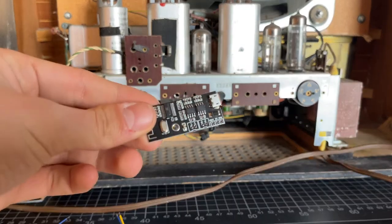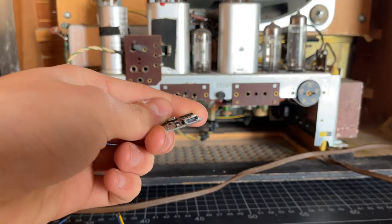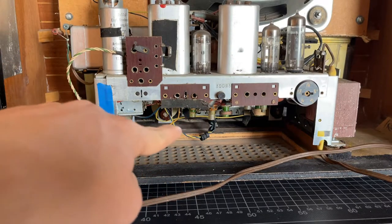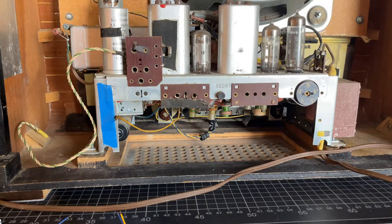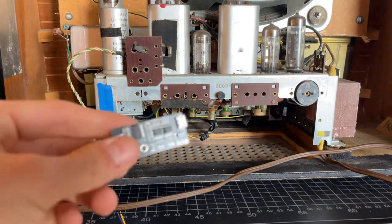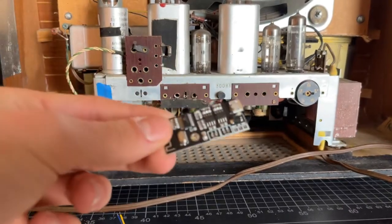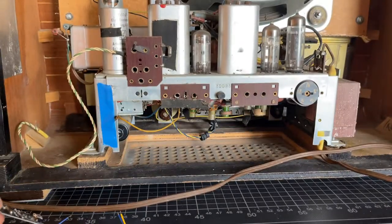This thing needs to be powered externally by micro USB. I'm not sure I'm going to be able to find a source in this radio for micro USB, because what I would ideally like to do is cut a micro USB cable and route it to a 5-volt rail somewhere in here. This is a 5-volt board and it only supports 5 volts — anything over will fry it — so I think we're just going to have to power this externally, but that's not too big of a deal.